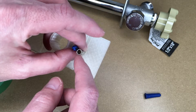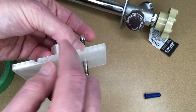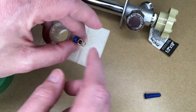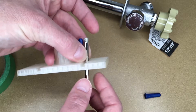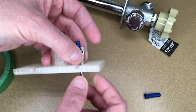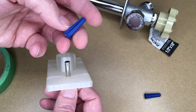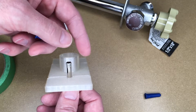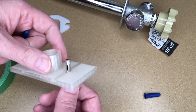Now this will leave a core. I don't know how well that's going to come out of the middle. I may need to take a screwdriver and bust the core out if it doesn't fall out on its own — I'm guessing it'll probably come out on its own. It's also possible that the core could come partway out, leaving a hole that's only half an inch deep instead of an inch deep. In that case I may need to stick a screwdriver in the back to break the core out, or use a regular masonry bit with a hammer drill.